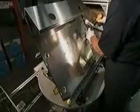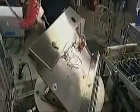This is the first of eight stops on an assembly line. A worker installs a transformer to power the blower's motor and two halogen lights. A circuit board regulates several functions, including three light intensities and the blower's four-speed motor.